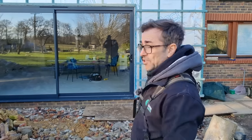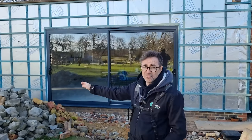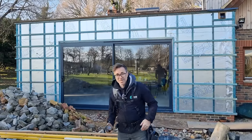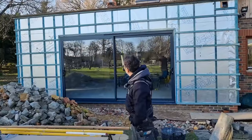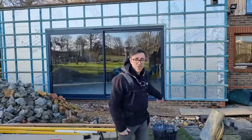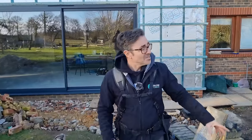So there's a lot of things to consider. We've got a dominating elevation here which is symmetrical — if we took a line straight down the middle of those doors we've got the same amount of wall on either side. What we want to do is make sure the cladding is as close to exactly the same either side, which means we have to effectively set out from the center of the doors. We need to make sure we can have a decent junction around the reveal, which is to the side of the windows, and that we end up somewhere neatly on the corner.